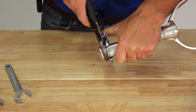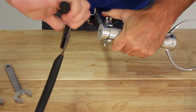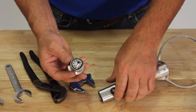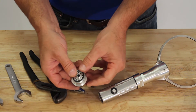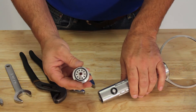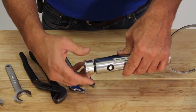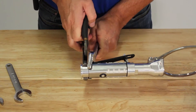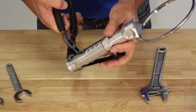To remove the air inlet attachment, unthread it from the motor. You'll do this to inspect the O-ring seal that is between the motor and the air inlet. When reassembling, make sure that the O-ring is seated into the groove on the air inlet, then reinstall. Do not over-tighten, as this is aluminum going into aluminum and can be stripped out.